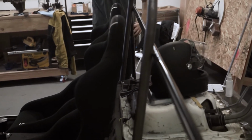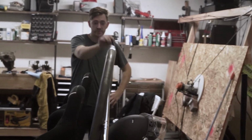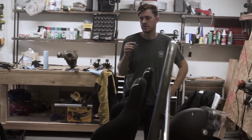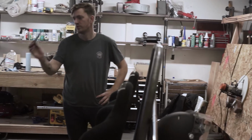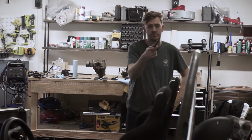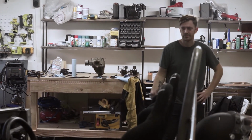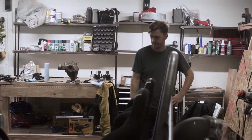We're a little bit out right here, but I think that once I get the drop bars and the crossbars in, which I'm just now realizing are gonna be a nightmare on this car, but I'll figure that out later. Once most of the cage is done, essentially drop bars, crossbars, front hoop, windshield bar, and then the support for the front, I can use a ratchet strap, tie it to something and pull that line back in. Once everything else is in place, crank it down. I don't think it's really gonna matter, but just to be safe, so we don't get any garbage that we have to deal with.